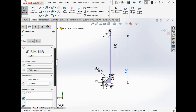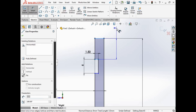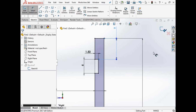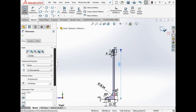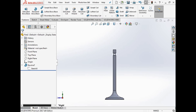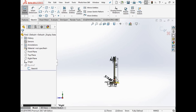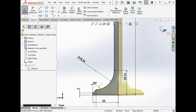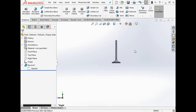You have to be very wary of where you reference things from. Instead, reference just from one of these surfaces — so that's 9mm from there. When we have it referenced that way, we get our normal valve, and when we edit it and say it needs to go down to 130mm, it stays 9mm from that surface. That's why it's important — reference things from where you think they're going to be adjusted. Using the origin is generally not bad since the origin is zero-zero-zero, but you need to understand what it means.